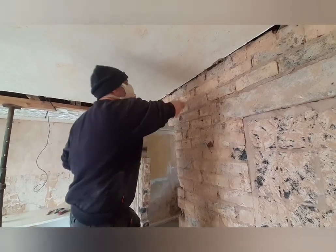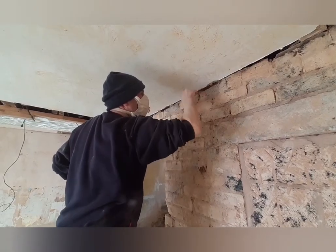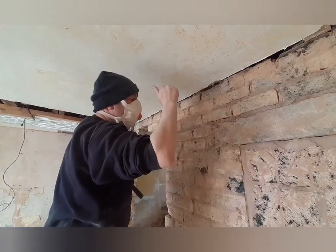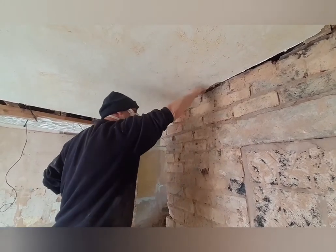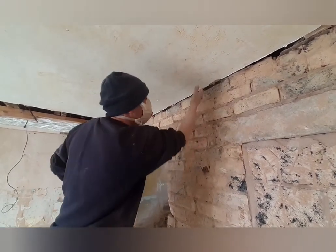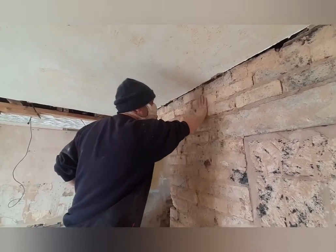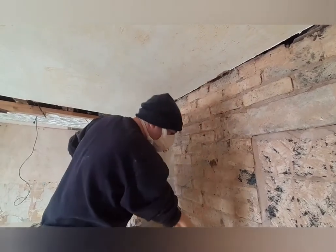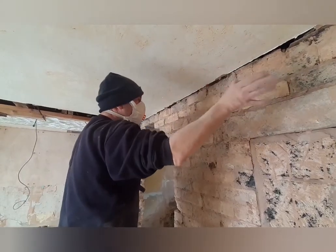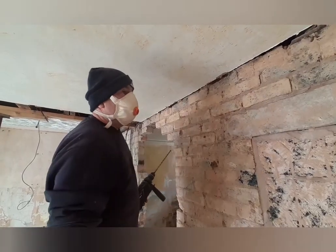What we're about to do is drill some pockets. I've already drilled a few, and basically the pockets in the top row of brickwork are for what's called the strong boys to fit inside. The acro props will then attach to the strong boys and help to lift the brickwork that continues above this wall, to be held in position while we take this wall out. That'll enable us to get the positioning right for the steels, and then acro-prop the steels back in to make everything safe.